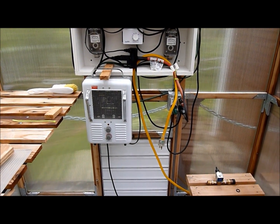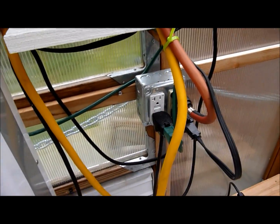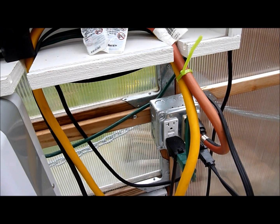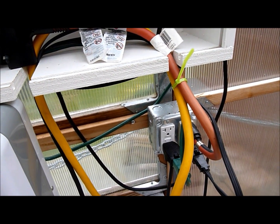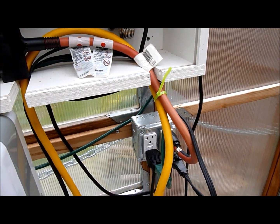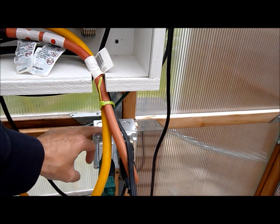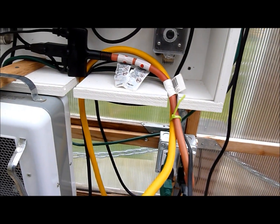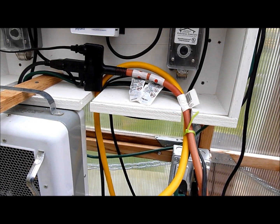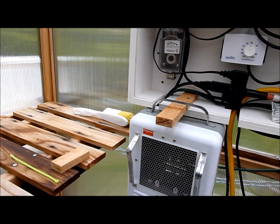Let's look and see exactly what's wired to what and how it works. First I want to show you some of the electrical. In this greenhouse, I did have an electrician install two properly grounded GFCI outlets that, if they get wet, will automatically kick off preventing possible electrocution. I have two different circuits, each with a 20 amp capacity. This yellow cord right here is going to go out to my secondary greenhouse — it's an extremely heavy-duty extension cord. They say never to use extension cords, but sometimes you have to make exceptions, and it is sort of a temporary situation for three months in the summer.